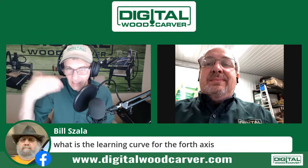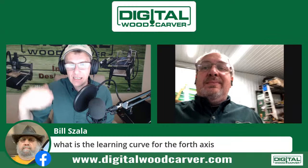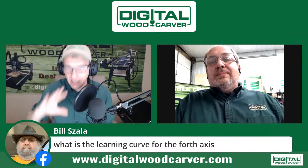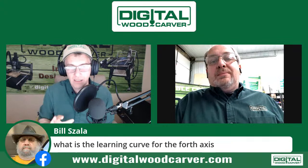Getting the machine zeroed out, zeroing out the X and Y and the Z and the A and everything, is rinse and repeat. It's the same steps at the beginning of every job. It's going to change based on the stock diameter, however, it's the same steps. It's the designing side of things and getting those models right that makes it a little bit of a higher learning curve.